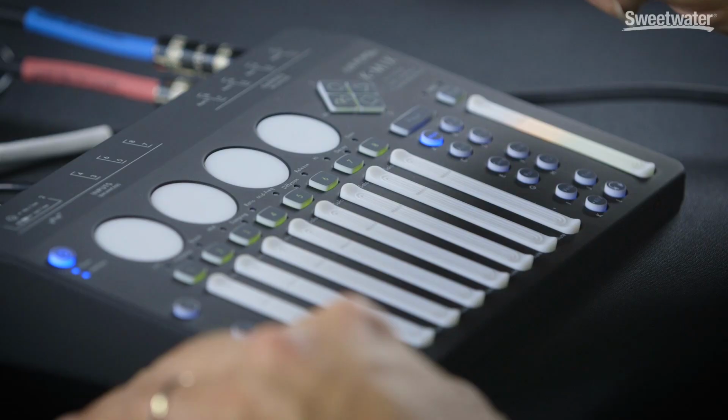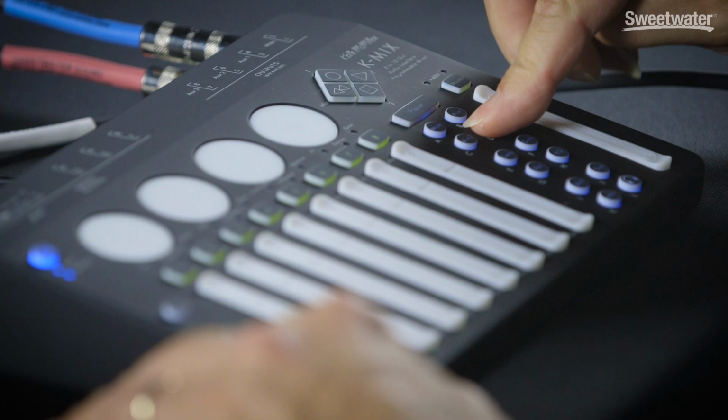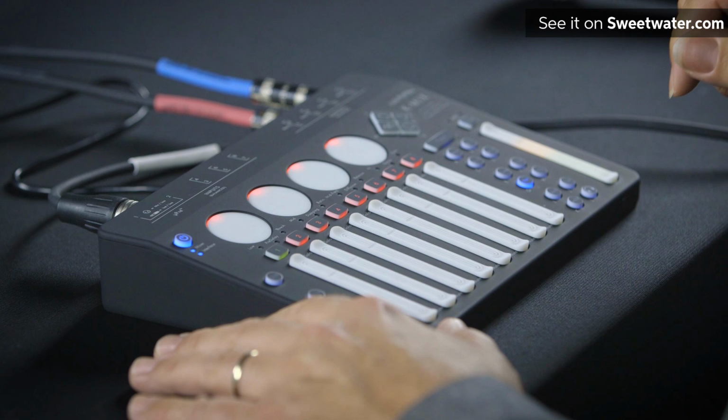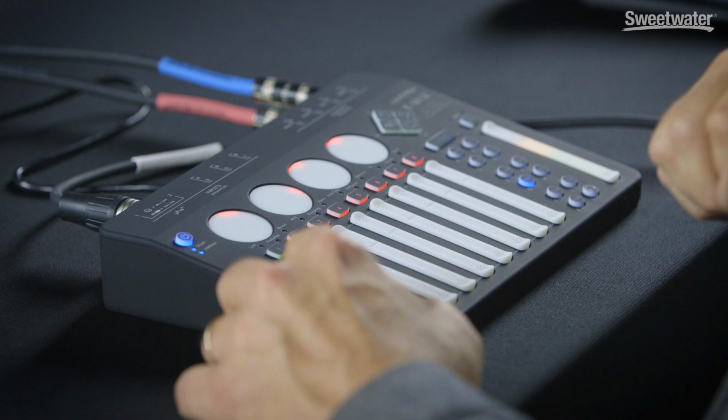Right now we're in main mode, which allows these to serve as our channel volume faders. When we're in aux mode, if we select aux 1, aux 2, or aux 3, these individual faders set the send amount from each of those channels. We also have pan control. So if we touch pan here, our first rotary controller sets the overall pan for the channel, and these 3 rotary controllers set the pans for our aux sends. You can return any control to its default setting by holding the bypass button and tapping the control.